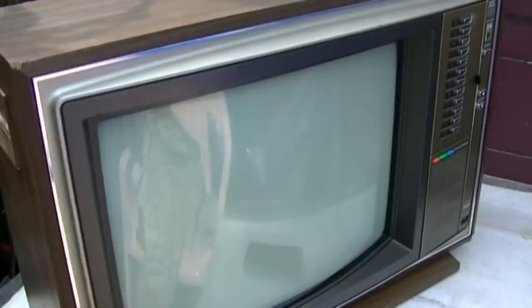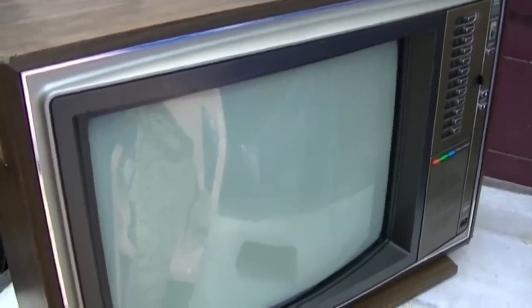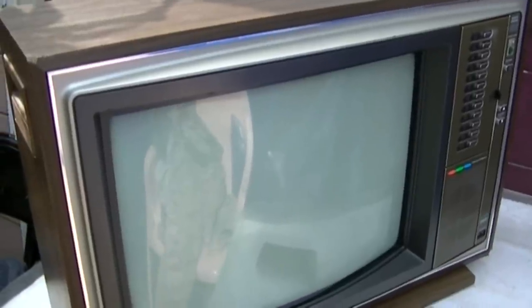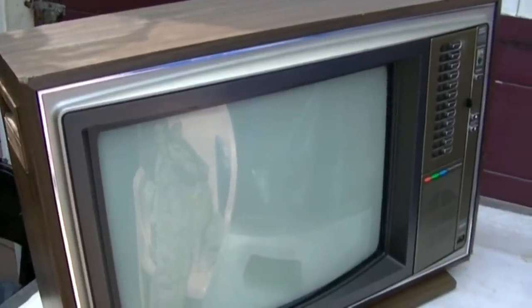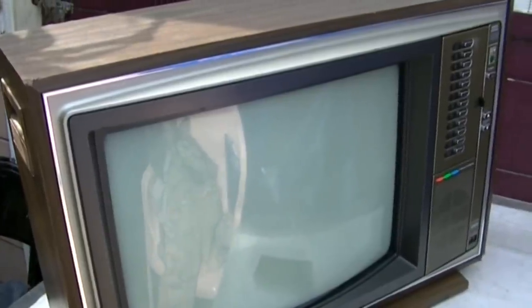It's got a nice picture now, but it seems to have this phase after it runs for about five minutes where it goes haywire for a minute or so, and then it straightens out and it's good. It's a very bizarre issue, but I really feel like it's in the CRT — because I tap on the CRT and it wigs out; I tap on the boards and it does not wig out. Anyway, there's a couple Sonys — kind of a rough, short video, but I just wanted to play with the new cap tester. I think it's going to really speed up repair stuff for me in the future. Definitely a worthwhile investment — and yeah, I paid for it, not sponsored.